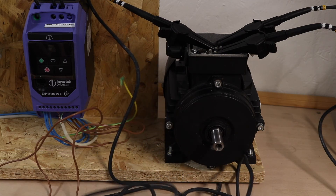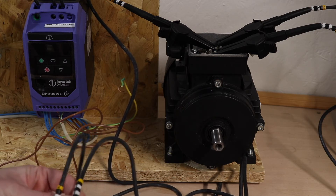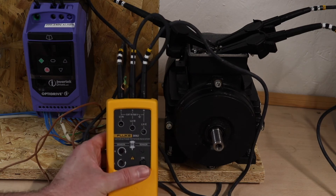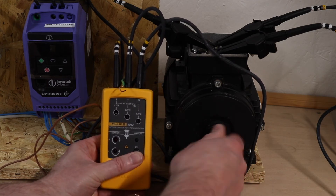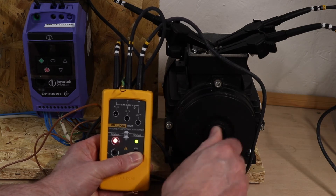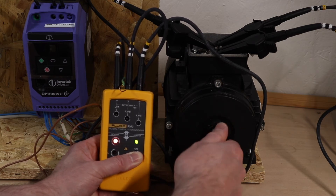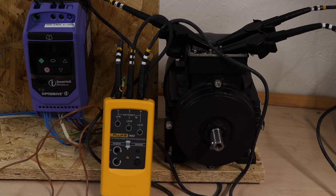Finally, doing the winding test with the Fluke. With no supply the Fluke shows no activity. About half a turn does it — similar sensitivity to the Amp Probe unit. All three units work fine for detecting winding connections for phase rotation. Next, I'll check if these will pick up such a small motor with their magnetic input.